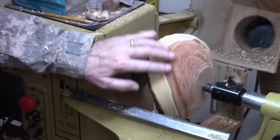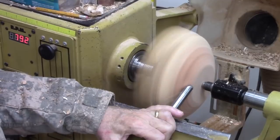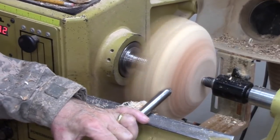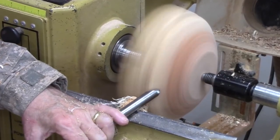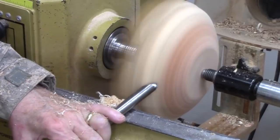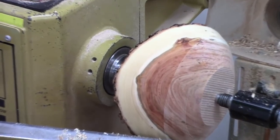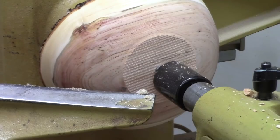I still have a flat edge here so I've got to go back and cut just a bit more. Now I start to shear scrape using the 5/8-inch bowl gouge almost parallel with the face of the wood, cutting on the lower edge, just moving it back and forth carefully and joining any cuts — trying to clean up any tool marks or bumps, trying to get a continuous curve especially where I've got the join on the top and bottom and up around the rim.